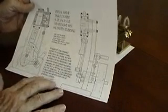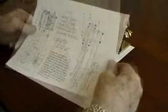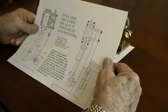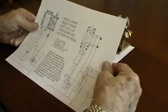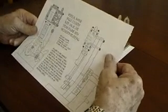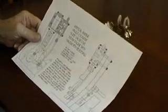I have changed the way it is made and I have put a very simple reversing linkage here. The original manual for the engine talked about Joy reversing gear and valve gear. But I have looked into it and, not that I am an expert, I think it is Hackworth. Anyway, I have made it slightly bigger and I have improved the breathing in the valving here. I will show you now some of the things that I have done so far.